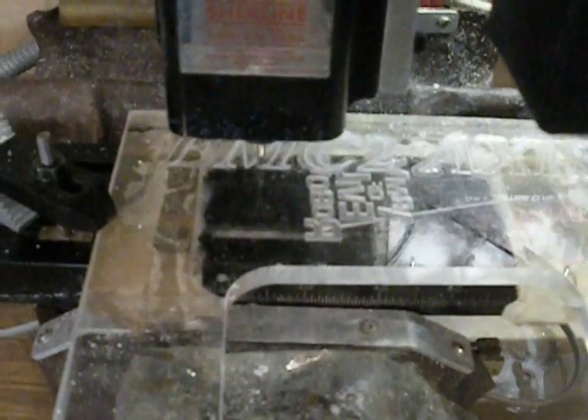This is about the 20th pass I've done on this particular milling job, so the repeatability is really good. You can see a little bit of scarring around the parts because of heat — cutting this acrylic heats it up so much that the colors just blast around it. I'm going to have to get a much higher speed cutting head.